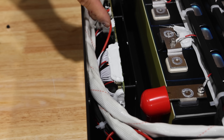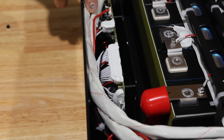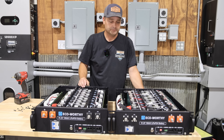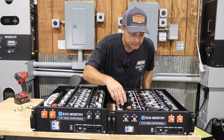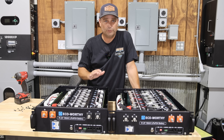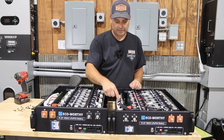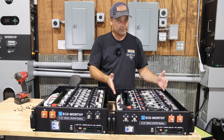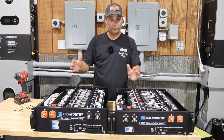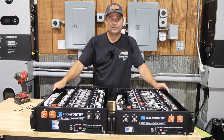On the BMS there is another change: all the connectors have RTV — they've been glued in place. The connectors, the wiring going to the front communication ports, the LEDs, and the dip switches are all glued in place. On the old server rack battery, nothing is glued on the BMS or the front communication ports. This is actually probably the number one reason a person receives a battery that's dead on arrival — during shipping, vibrations cause little ports or wiring to unplug. Having all this glue on the connectors improves quality control and helps keep those connectors from ever coming out on their own.